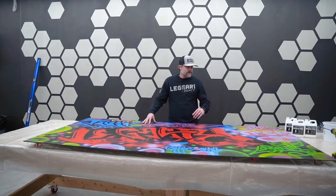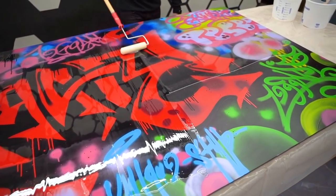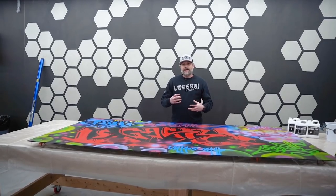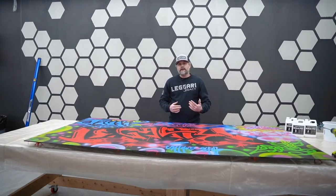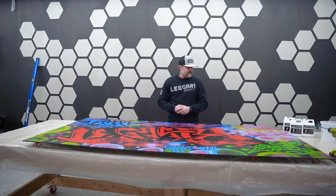Used a lot of different colors. So we're gonna flood it, use a foam roller, and we're gonna be doing 3 ounces a square foot. If you put on our metallic epoxy too thick and clear, it'll have like a white haze to it because of the defoamer agents in it, which makes our resin awesome because you don't have to torch it. But if you put on too thick, you will have a little haze to that clearness.